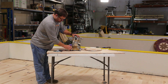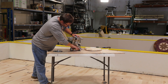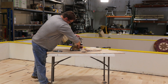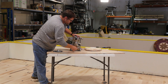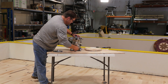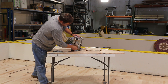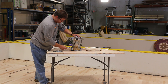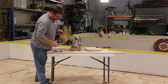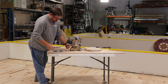I'm going to adjust this down so it can rest on the three pennies. All I have to do is take a wrench — there's a locking nut here and a locking nut here. Once you get those loose, all you do is turn the caster bracket up or down depending on what you need. Obviously I've got to go down, so I'm going to make the caster come out the top to lower the whole frame. If I needed to raise the frame, I would crank these down and it's going to pick up on the back.